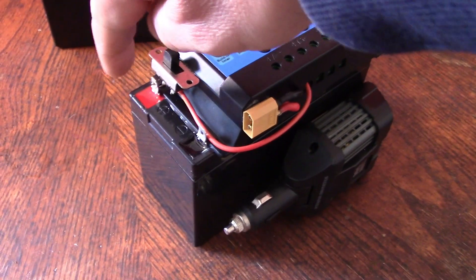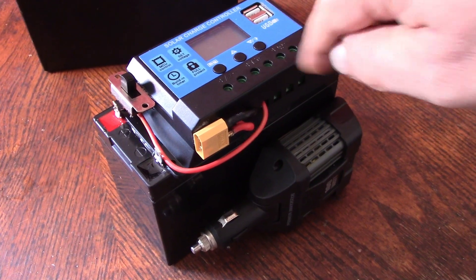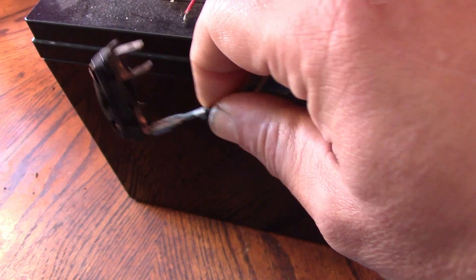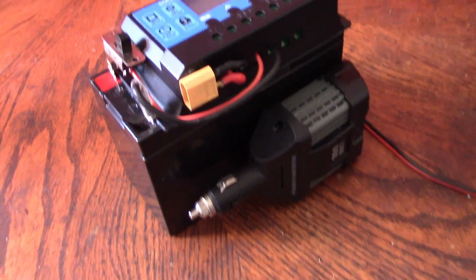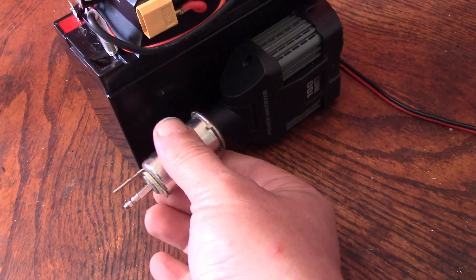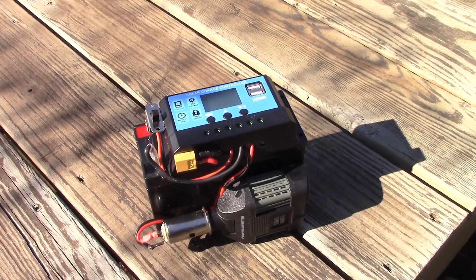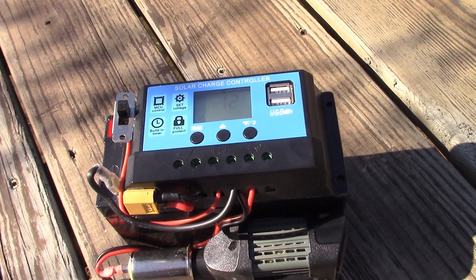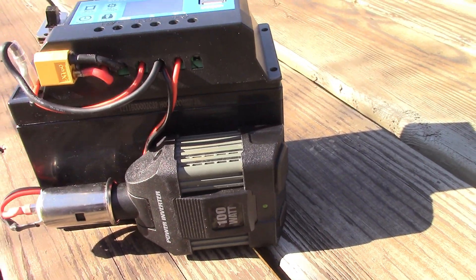That's those on. I'm using E6000 glue to attach everything. Next will be a solar connector, which I'll put there so the wires will reach, and then the main power switch. I've got the positive of the battery going to one side of the switch and out into the positive on the charge controller. For the negative, I found this old battery with the correct kind of connector on it, so I'm taking that off — that will form the negative connection from the battery to the charge controller. Next, I've connected the car cigarette lighter socket, which will allow either connecting to the inverter or plugging in other things. And there we go, all finished. Powering it on for the first time — 13.2 volts, and the green light's on on the inverter.